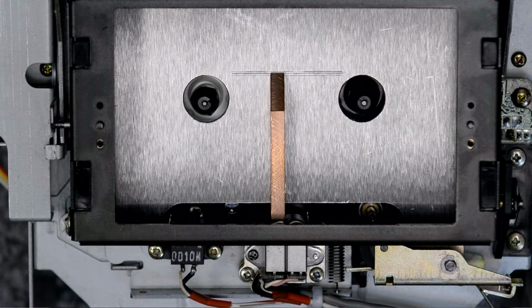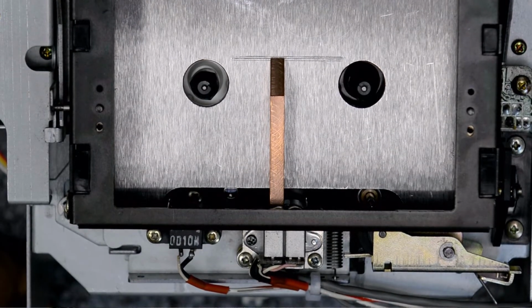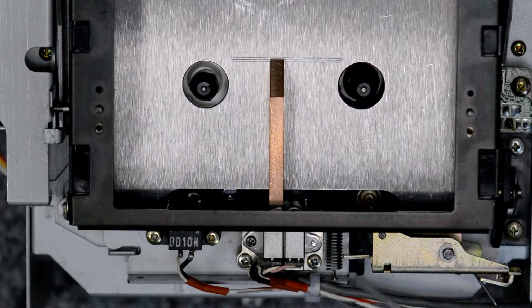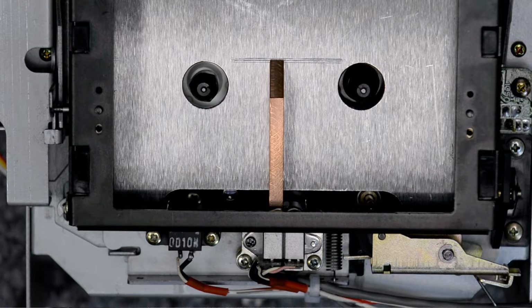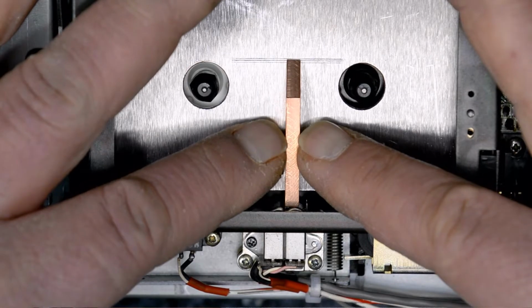And it's actually, I think it might be a bit too much. Those lines are half a millimeter apart. A millimeter's around 40 thousandths, say 39 something. So those marks are about 20 thousandths between them. And that's where it gets adjusted right there. So I'll look again.